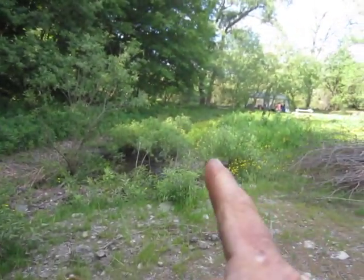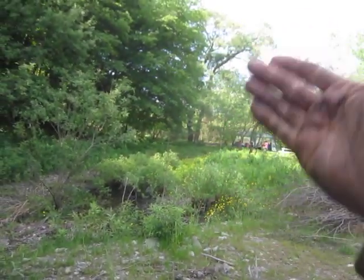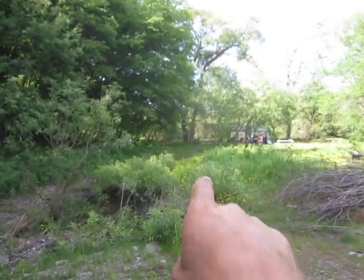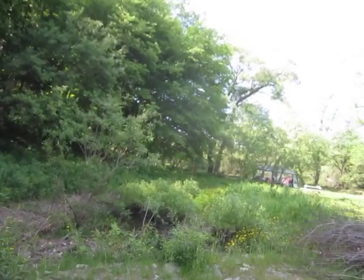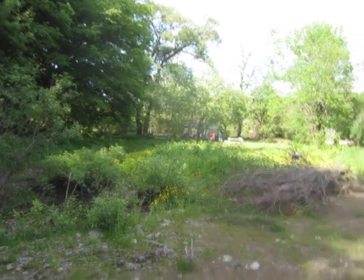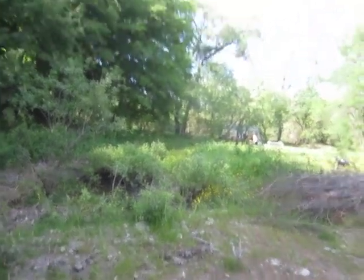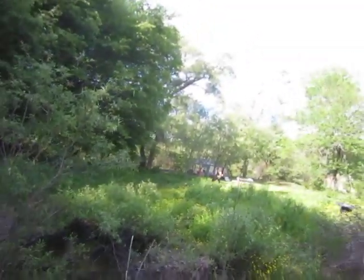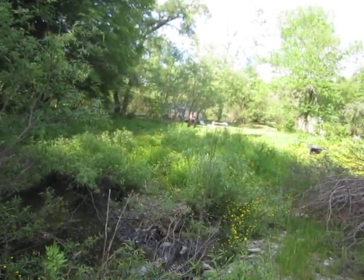It's perfectly level — if anything, from the pond to the top of the creek bank it's downhill. Once we get the water out of the creek, it's between level and a little bit downhill for about 200 to 250 feet. So the water only has to come up out of the creek about eight feet. I was leaning towards a ram pump, but I think I'm just going to go with a solar powered pump.